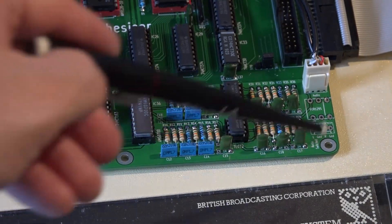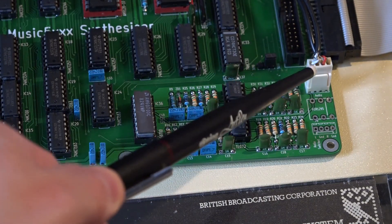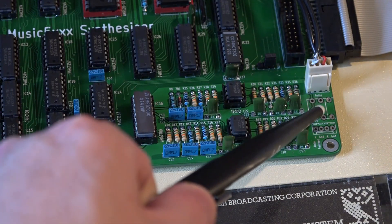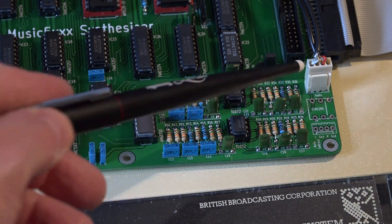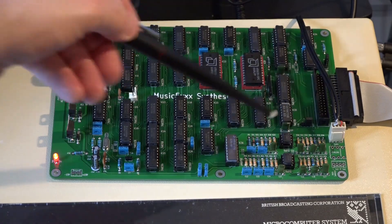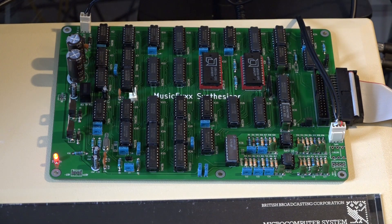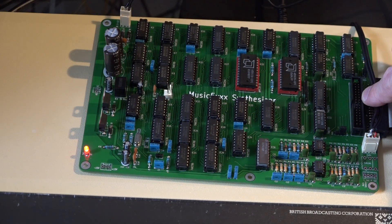On this side of the board, this circuit here is the amplification circuit — left and right op-amps — and that then goes on to the output here. You can actually fit a jack socket there if you wish. In the case I'm probably going to mount this in, I'm just going to have two quarter inch jack sockets bolted to the side, so I've just got the connector going to some phonos for now. The rest of the chips on the board are basically various logic circuits. There's also an additional connection there for adding additional boards.